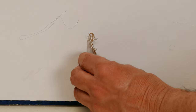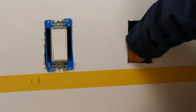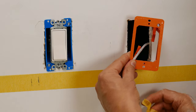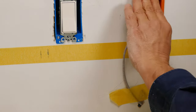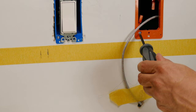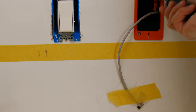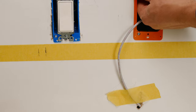Once it comes out through the hole, bend it and feed it back in while you reach in from the top to grab the wire. Once you get it through, take some masking tape, feed it through, and tape it to the wall so it won't slip back in. Then feed it back in and get it flush. Take the Phillips screwdriver — you'll see what happens with the little tongue; as I turn the screw it goes down underneath and stays there as you tighten it. Same for the top one, and then it's locked in place — both tongues in the back are locked. You're ready to go.